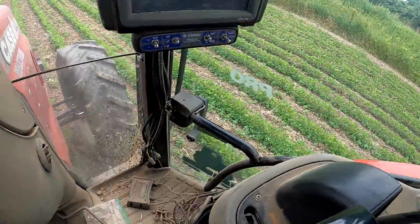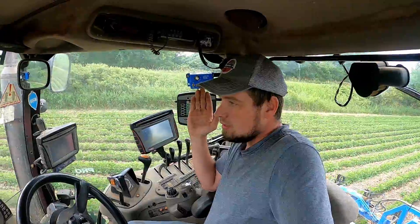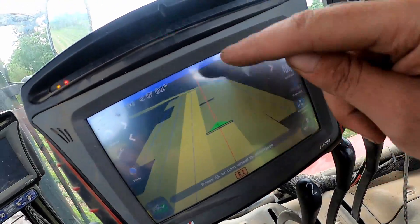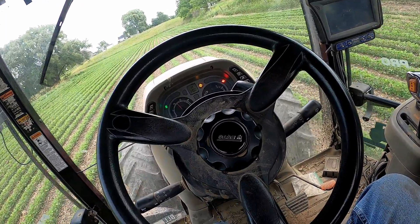This is the GPS that drives the tractor right here - there's a GPS globe on top of the tractor. There's also a wireless internet modem down there; there's actually Wi-Fi in this tractor. All these things communicate with each other. When we plant, we make a line on the screen and it will repeat that line across the screen, keeping this tractor within one inch of that line every time - it's called RTK, it's very accurate. It relays the information to the steering wheel, and you can see the steering wheel is turning itself. This is a retrofit on this tractor; you can purchase tractors now where it's all integrated into the hydraulics and the computer system.